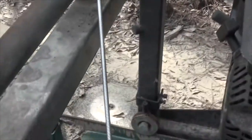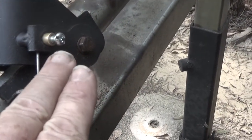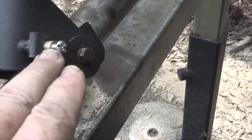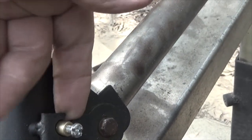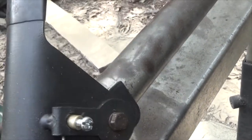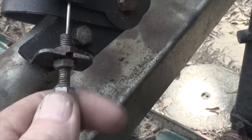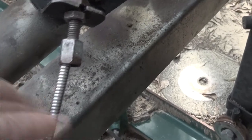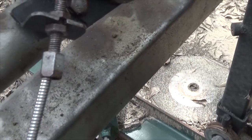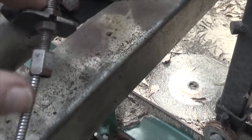Over here on this side, the cable — which I'll show you in just a minute — it's old school, with the lead bead that fits in here. There's a slot right there. The cable feeds in and then swings around this way. This is what you use to tension this cable, so that when you squeeze on it, it pulls the cable instead of just the sleeve moving.